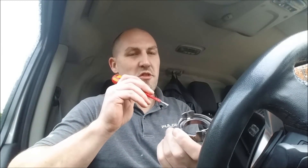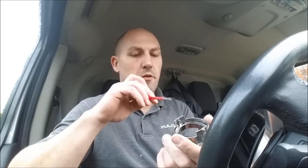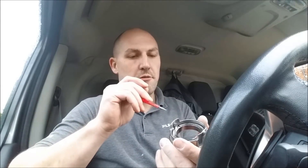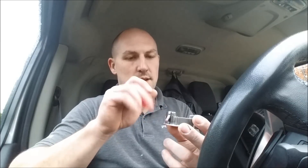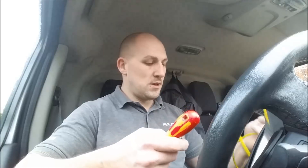So I need to find a way around that problem, and I think I've found it. What I'm going to do is — here's a little capsule that comes out, which is also metallic. It looks like there's a little bit of room on this where I can drill a 3 to 3.5mm hole, thread it, put a nut through it, try and cut it off as flush as I can, file it down, and attach a bit of my own earth cable. That should get around the problem.